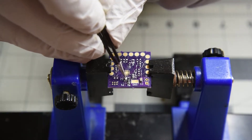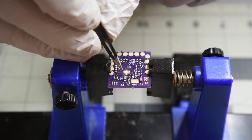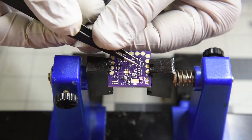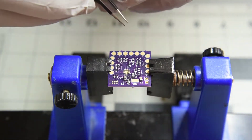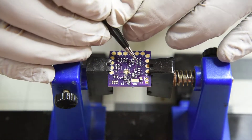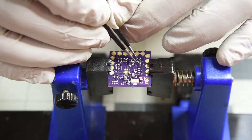These little test boards have all 20 QFN pads connected to something, even if it's just a test point to check with a scope. I did include one LED. Seems the LEDs are about the most temperature sensitive part — I guess it's hard to make clear lenses that hold up well to high temps. Anyway, if I melt the LED, I know I've overdone it with the heat.